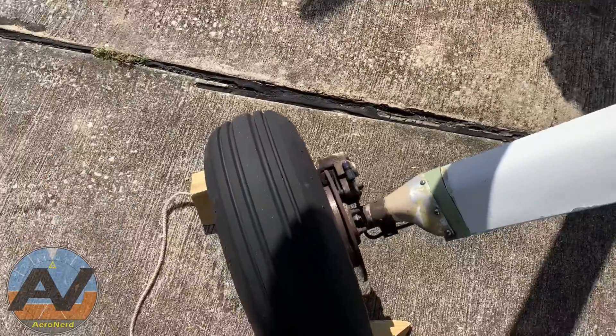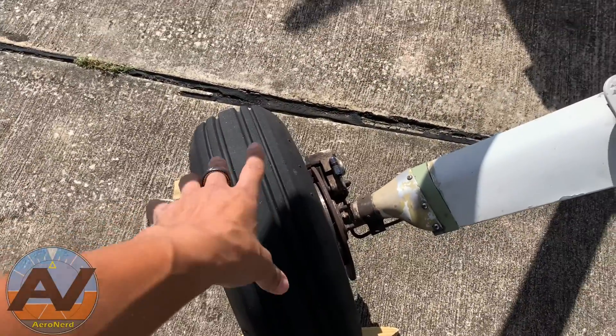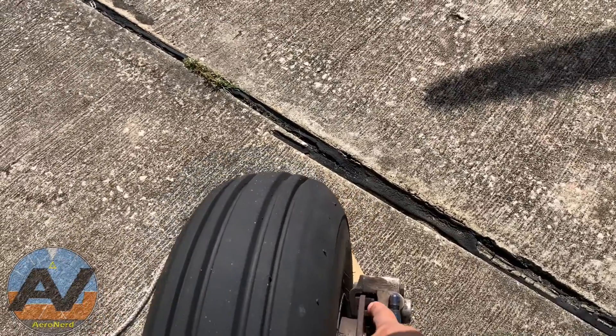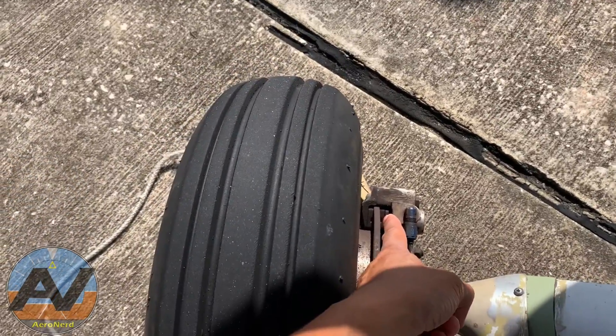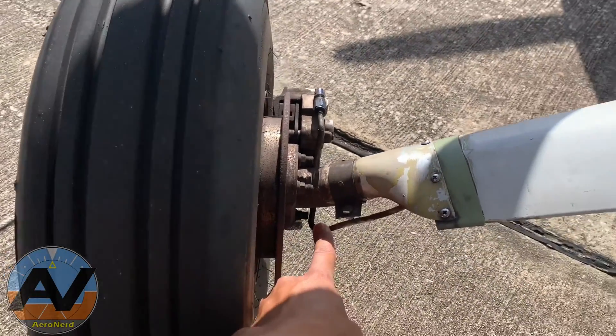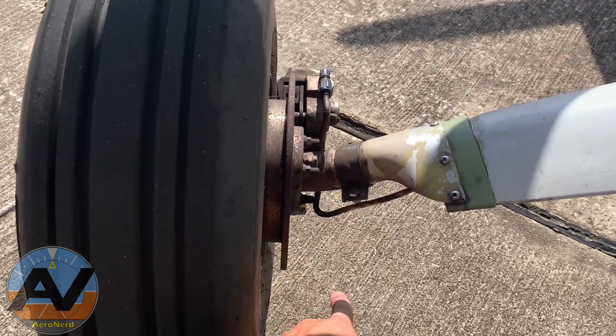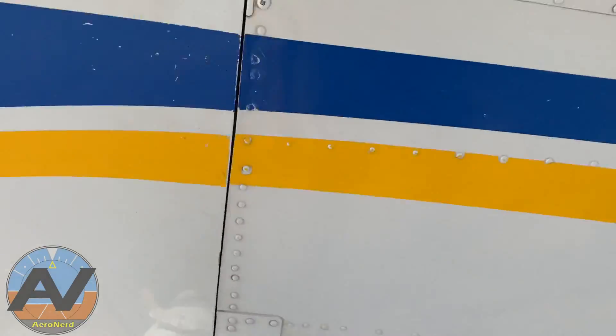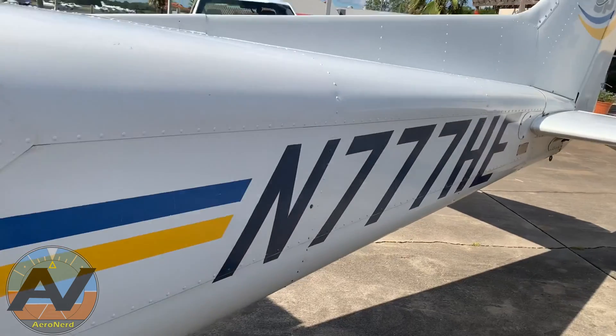Since we're right down here, you want to check the tires — make sure the tread is good, you don't want any flat spots. Here's the rotor with your disc brakes right in there — make sure they have plenty of life available. Here is your hydraulic line; make sure there's no red fluid dripping down, because that's going to be a bad thing.